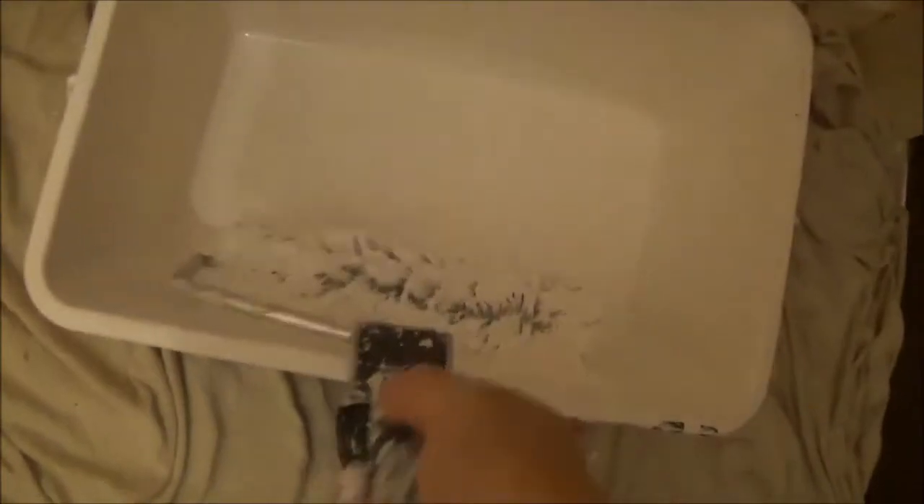I've actually painted that cornice as well, and I've cut in all around the ceiling, so it's time to roll it now. You want to roll it in squares — I'm also cutting round the light. Take a nice dip out of your roller bucket. I'm not going to use a roller pole in here, it's that small. Just spread your paint out on the ceiling — basically that's it, just don't touch the wall. Repeat that process all over the ceiling. Make sure you spread it out nice and evenly.